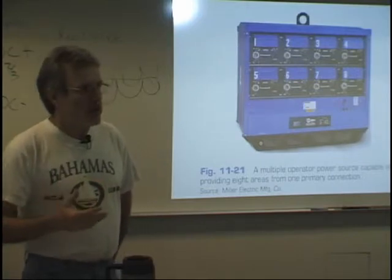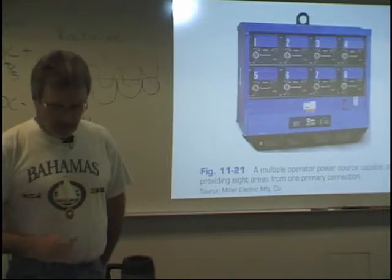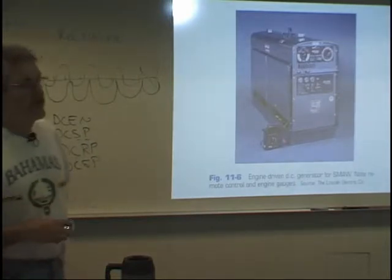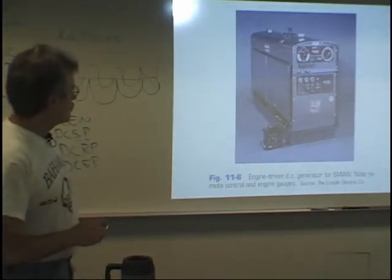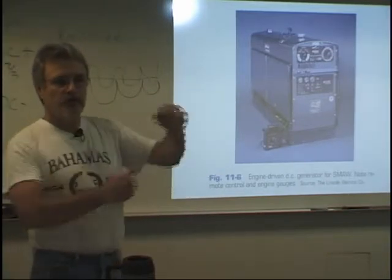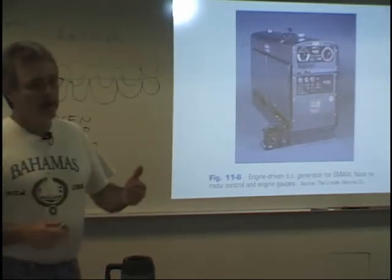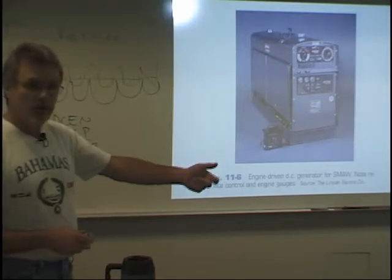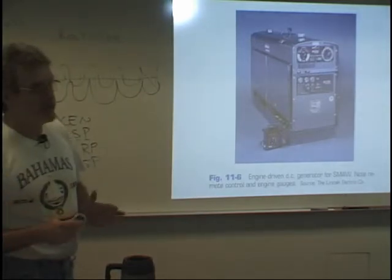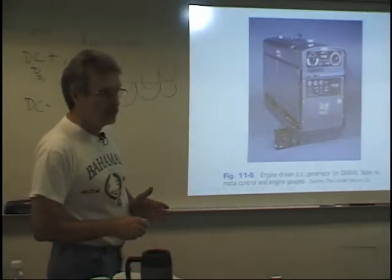If you're doing submerged arc welding or gas metal arc welding, those are going to have a 100% duty cycle. Some of these other machines, like that and like that, they'll have about a 30% duty cycle. The duty cycle changes. But if you're doing something like this and you're stick rod welding, you have to think, well, I'm always stopping, cleaning, brushing, grinding, changing electrodes. So you're not really running it, and they don't get a chance to overheat. But if you're doing submerged arc or gas metal arc where you're just pulling the trigger and you can weld for 20 minutes without stopping, it would overheat. So that's why those have a 100% duty cycle. So duty cycle, you will have a question or two on your test about duty cycles and what their purpose is.